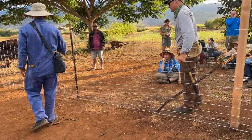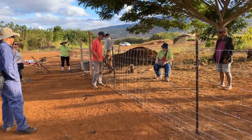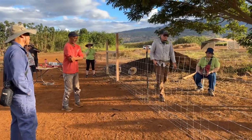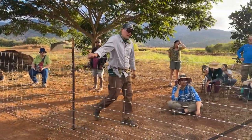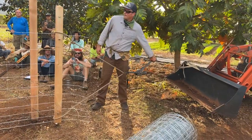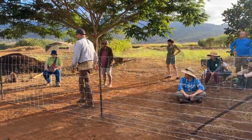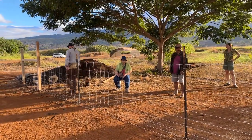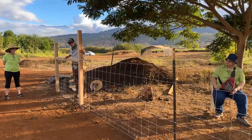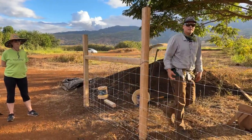And then I like to take a feel of it, see how tight — sometimes you'll come around the fence and you might see some, if you're using old fence, sometimes you've got to like take out a kink or open something up. It's always pleasant working with new fence. And then just keep feeling it for what kind of tension you want. If it feels good, make it tighter. And I like to look at the quality of your H brace or whatever you're pulling on — coming back over here and taking a look at it. You've got all this force coming on here, and in this scenario it's not pushing at all yet. Everything's getting pushed on here and it's not moving.